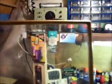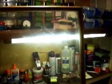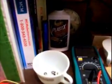Alright guys, what do you think? That's after the Plastex application on that cover. Boy, it took all that yellow haze and the weird funky marks out of this right side here. It brought it back to clear, that's for sure. Wherever somebody was real abrasive with it though, it didn't take that out, but it sure did brighten that up. That should look really good on there now. I recommend that product. It's Meguiar's Plastex, and it works really well. This is proof that it does.